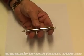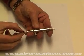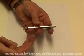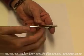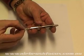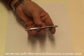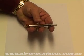Okay, I'm going to take the handle off the airbrush. I'm going to loosen the needle chuck. Note the way I again hold the airbrush with the air valve coming down the middle of my four fingers, thumb on the trigger. Just give that a quarter turn only, take the needle out, and then I take the head off, and what I've got to do now is remove the entire rear spring assembly.